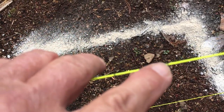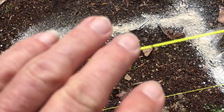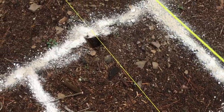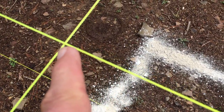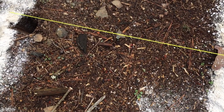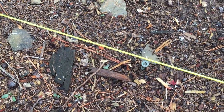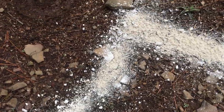And this is the actual 8 foot from the corner. This building is 12 by 16, and I wanted a pier right in the center of the sill log to give it the support that I wanted to have. And at the other end, I came back the 10 inches from the actual corner and dropped a plumb bob and marked my perimeter of the pier for the footing out. You can see the little screw there that I stuck in the ground and measured out 12 inches all the way from that. Measured out 12 inches either way to get the outline.